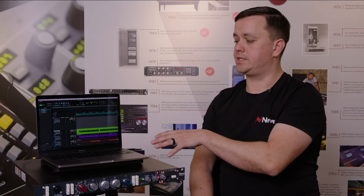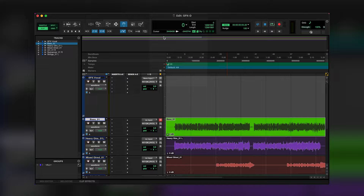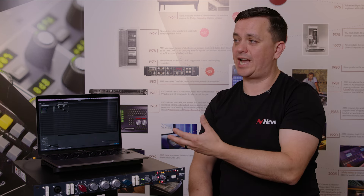When the SPX-D is connected to your Mac, it appears as a Core Audio device and you set it as your playback engine. In the I/O tab of your DAW — we're using Pro Tools here — you can see analog inputs plus eight ADAT inputs. If you want to expand, you can add eight additional tracks via ADAT, for example by connecting an OPX for multi-track recording, giving you nine total inputs via USB into your system.